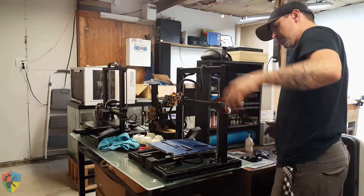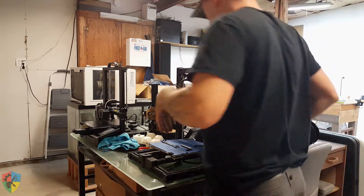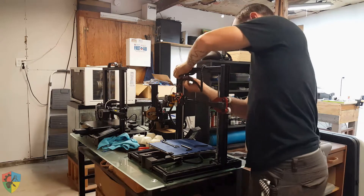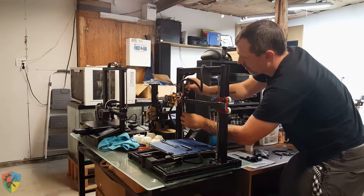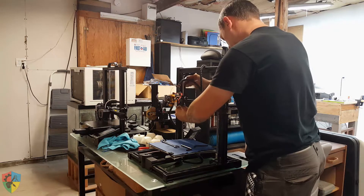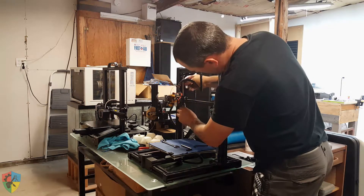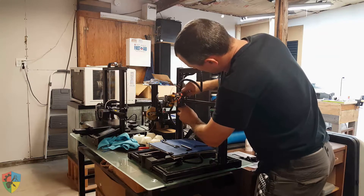I knew it was the problem but I wasn't entirely sure why. The reason the gantry was wobbling no matter what I did was that inward tension on those nylon wheels. You can see the one pair right next to me directly connected to the new bracket — those are what allow the gantry to glide, because they're nylon wheels on painted aluminum, so it moves very smoothly with very little resistance as the screws turn to move the gantry up and down.